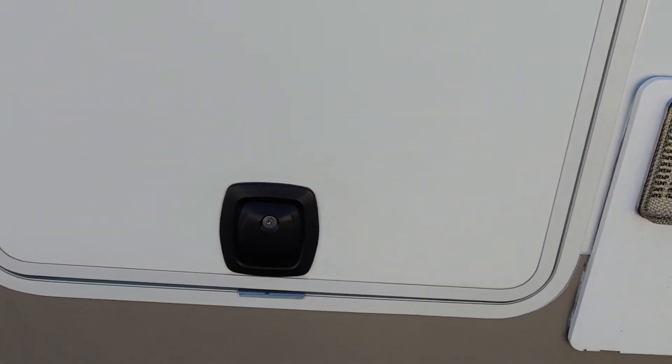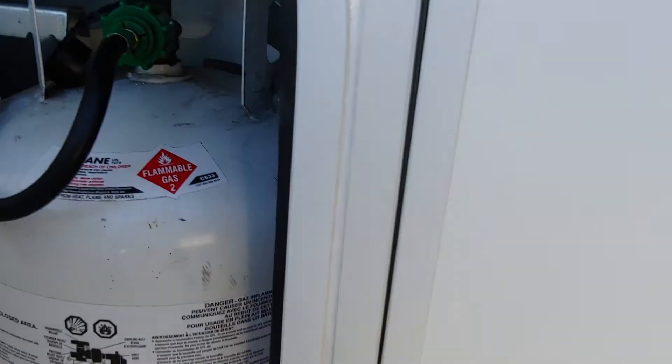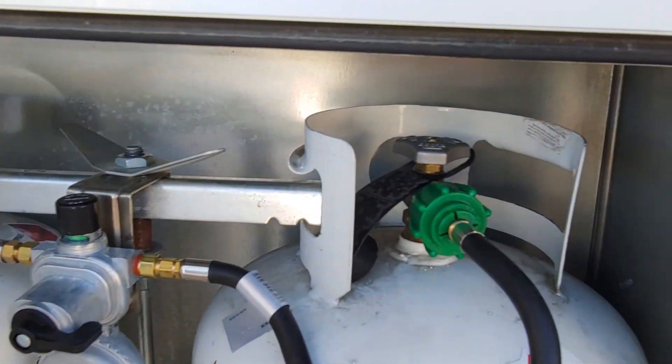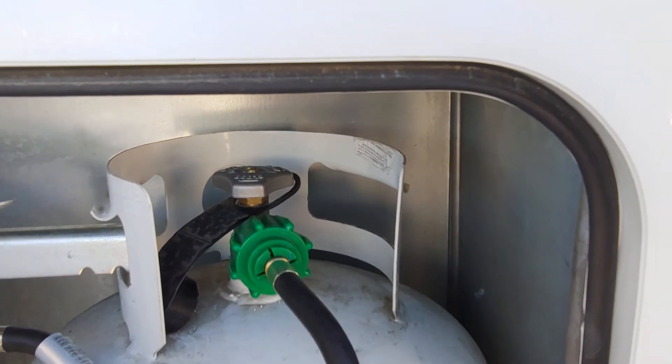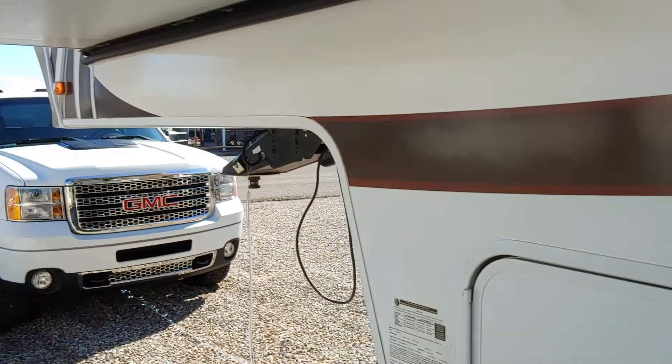In the basement, where the hose comes in, I just add a little extra insulation by putting rags around the hose. In addition, this metal box around the propane tanks goes right into the basement. I put cardboard on the other side of the metal box to give it a little bit of insulation. The basement stays at 44 to 45 degrees even though it's 17 degrees outside.